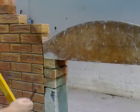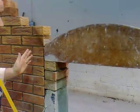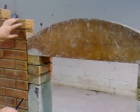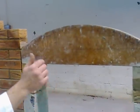The reason we do this is because it's imperative that both sides of the arch are symmetrical with each other. In other words, the cuts for the skew backs on the left should be a mirror image of the cuts of the skew backs on the right. So once we have them marked, we can take them down, bring them into the saw rail and cut them.